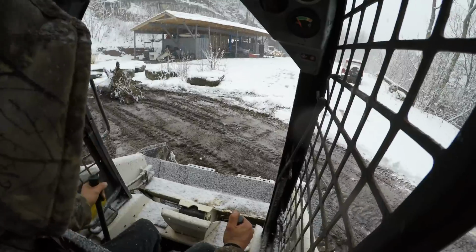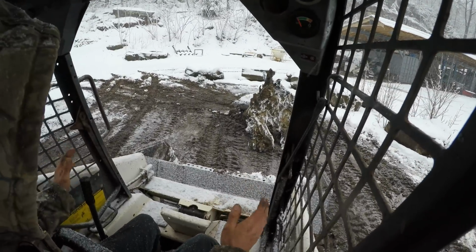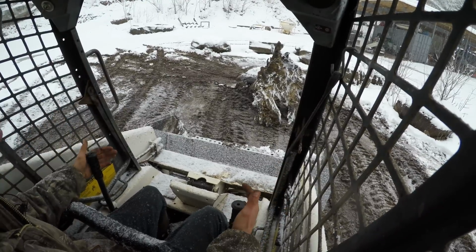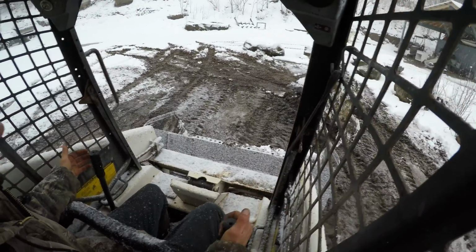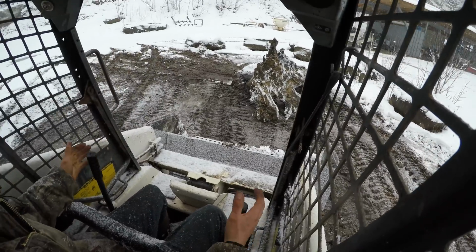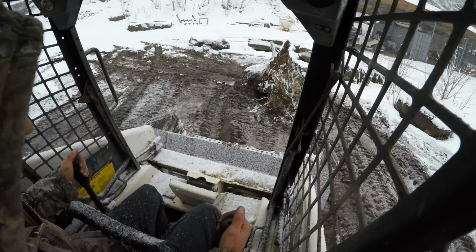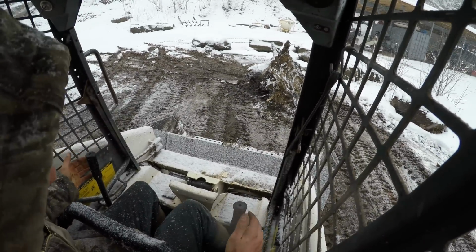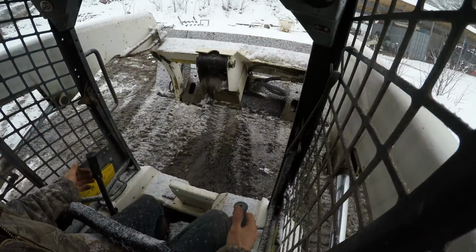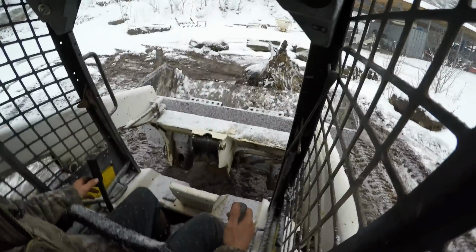Videos on how to operate equipment, and I was planning on doing that, but let me just throw in a little piece right here now. So in this skid steer, this is an older machine, but you got your two sticks. That's forward, reverse on the right side, and likewise here. And the further you push it, the faster you go. The bucket controls are all done with your feet, so this is my left heel to back, left foot forward, right foot back, right foot forward.